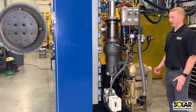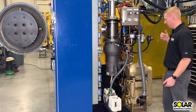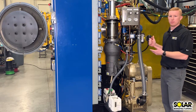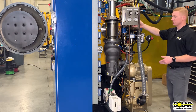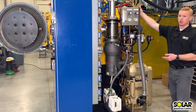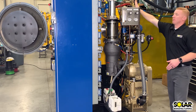Our standard Mentor pumping configuration consists of a mechanical pump, an oil-filled diffusion pump, and a holding pump. The compact nature is designed to save space while still maintaining access for all of your maintenance purposes. You'll also see all of our gauges for easy access for calibration as well as readouts on the digital display, and all of our butterfly valves show an open-close configuration for easy access and maintenance.